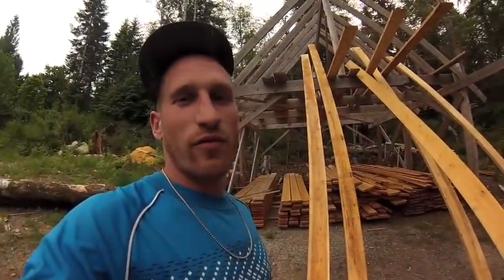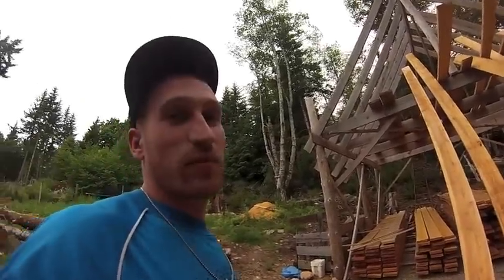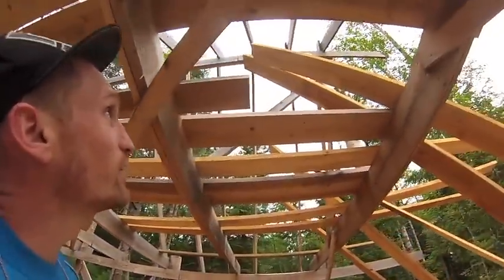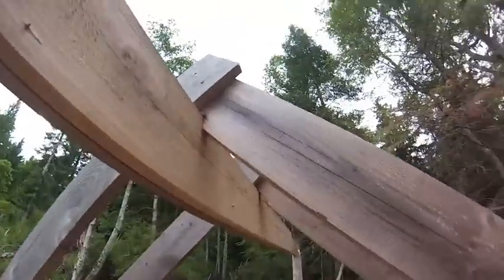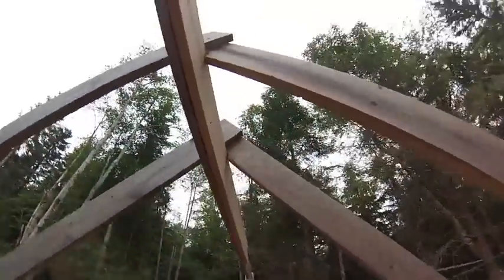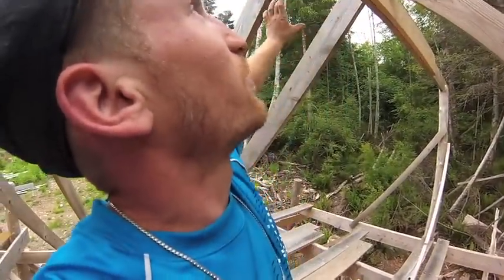We are back with part two of the timber frame carport build. You can tell how long it's been between the last video and this one by the color of the wood - it has aged quite a bit. I've done a couple small things: I put up some floorboards and a couple of the rafters. We're putting a little joint, a little notch right there, and it sits on that. On the top I left it running out wild and we're going to cut that off flush on both sides. That's going to make a really strong joint, especially if I put a collar tie in above head height to strengthen it up a bit more.